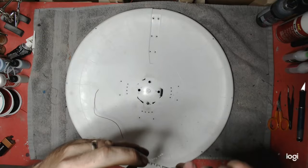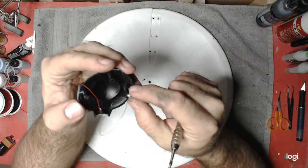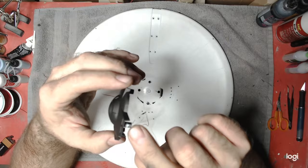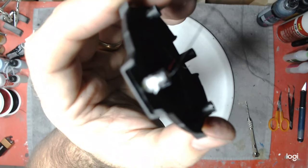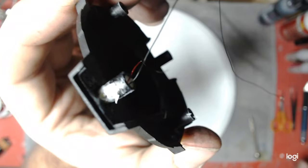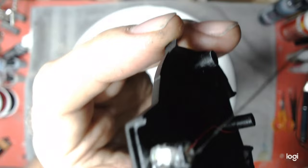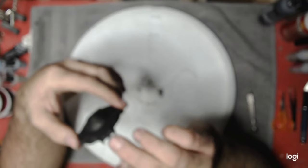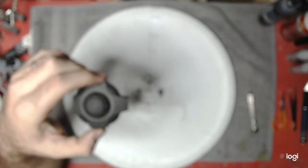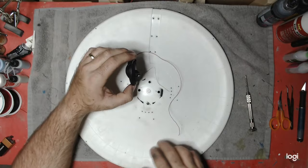What that let me do was take an SMD with these small wires that the SMD uses, and it allowed me to feed these wires up through this pin. You can see where the diode is just sticking out of the hole there. It's actually right at the base here at the bottom - that's where the diode is. What that does is it brings the light up enough to allow it to shine down from the dome and actually light the hole itself. Then it's just a matter of using that clear piece insert, light blocking that, and reducing that beam to where it just does that V like you saw. That's how I'm doing this, and that's what I'm going to do with these other two sides.